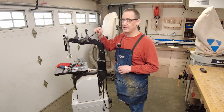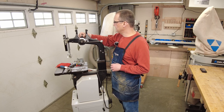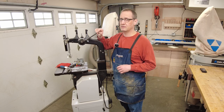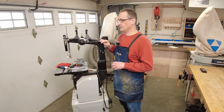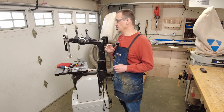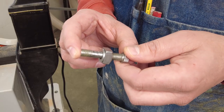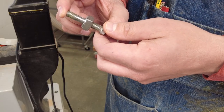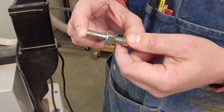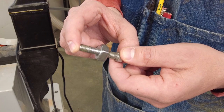As I was doing that I heard a big pop. I tried making some adjustments and did it again and there was pop pop. So I figured well that's not good — let's pull things apart and see what's going on. This bolt is important for tensioning the band saw and as you can see there's about a half an inch of thread that just got completely stripped, so I need to replace that.